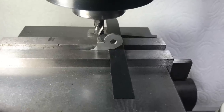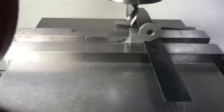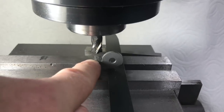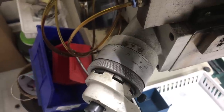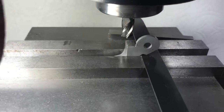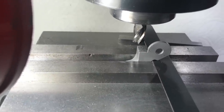What I've done is taken the lifter arm, flipped it upside down, and put it into the vise of my milling machine. I have an end mill about a half-inch in diameter — you can use one wider or smaller, but you want one that at least fits the width of the portion you're cutting. I touched base with the portion I'm cutting, interfaced it, zeroed it out, and pulled it back past the cutting portion of the lifter arm. I'm going to bring it down ten thousandths of an inch at a time. Starting with ten thousandths is a reasonable amount of material removal — you definitely don't want to start with more than that unless you're experienced with these kits. Then add a little cutting fluid and start up the milling machine.